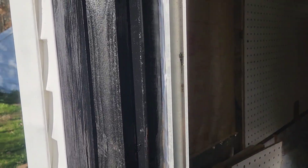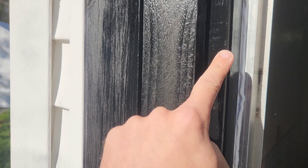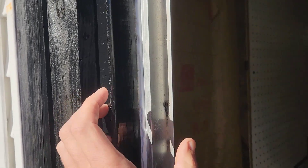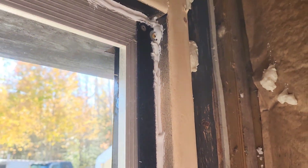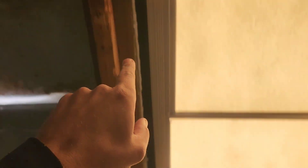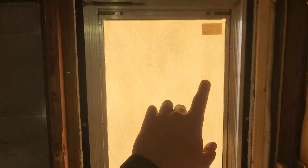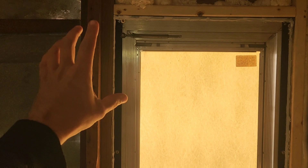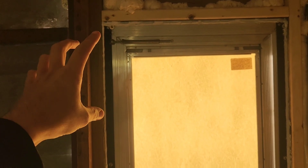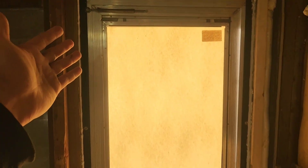Right here, as you can see, we've got a piece of strapping that is a 1-inch piece, so that gives us a half an inch of leeway in each direction. In the frame as we come around, there's a screw in all four corners with a washer on it, and that allowed me to level it out and set it where it is. Then I've gone around the outside with soft silicone so that it doesn't become hard and rigid — it'll still float the door a little bit. And that's what I did for that.